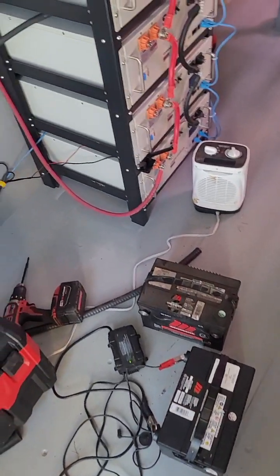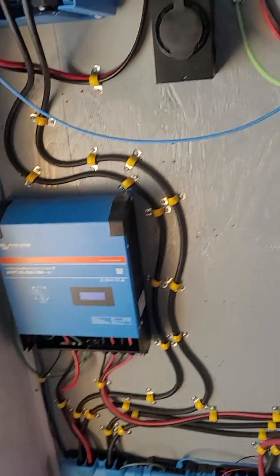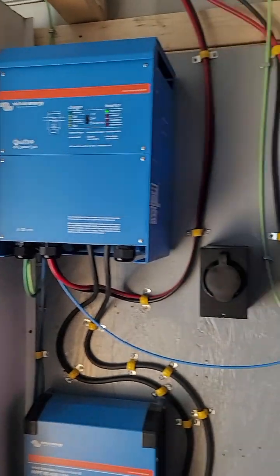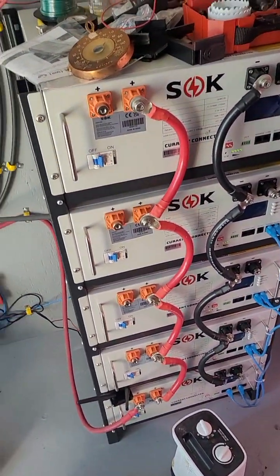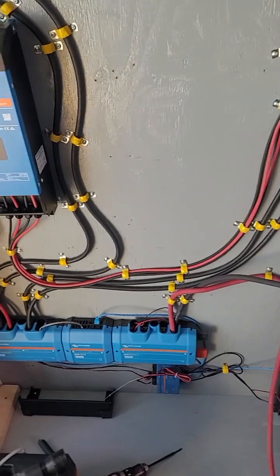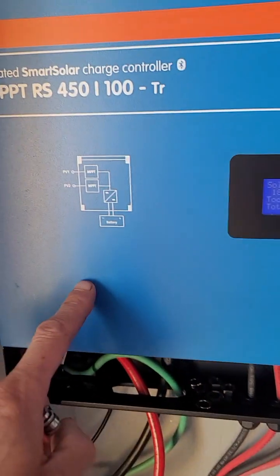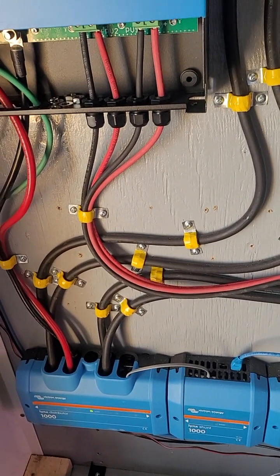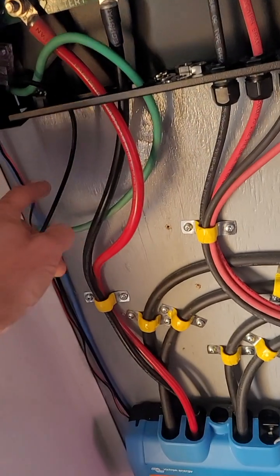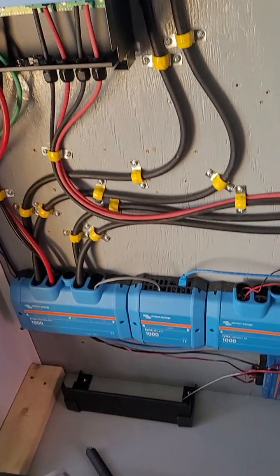This is our first video for Salty Greens, going over some of the challenges we had with our solar setup. We have two Quattro 5 kilowatt boxes at 48 volts and a full rack of SOKs. One issue is interfacing the RS 450/100 MPPT with data communications. Over here is the VE.Direct cable — I'd recommend that approach as it reduces issues you could have with the CAN bus.